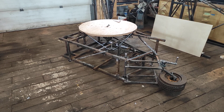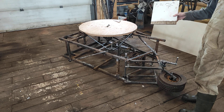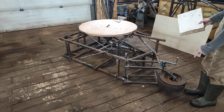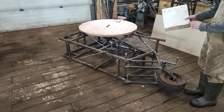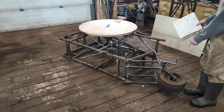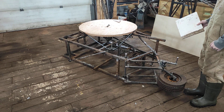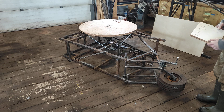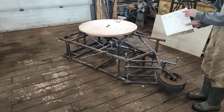Our energy comes from centrifugal force, which is mv² over r. So we have lots of mass — this is about 96 pounds — and velocity squared. We want some speed, and over radius we have a fairly small radius, about seven inches to the center of mass. So you can see most of the power is in the speed.